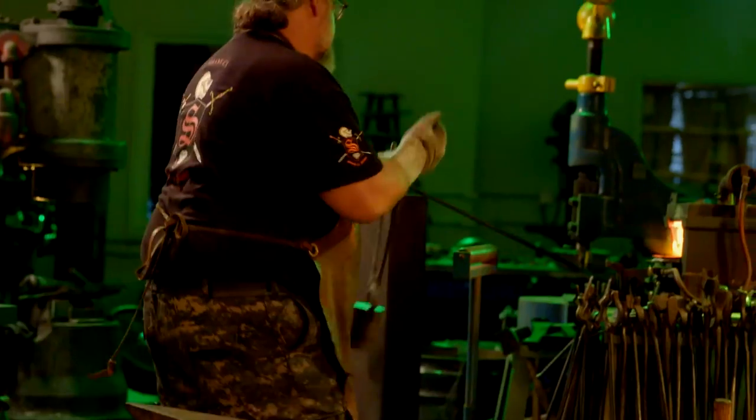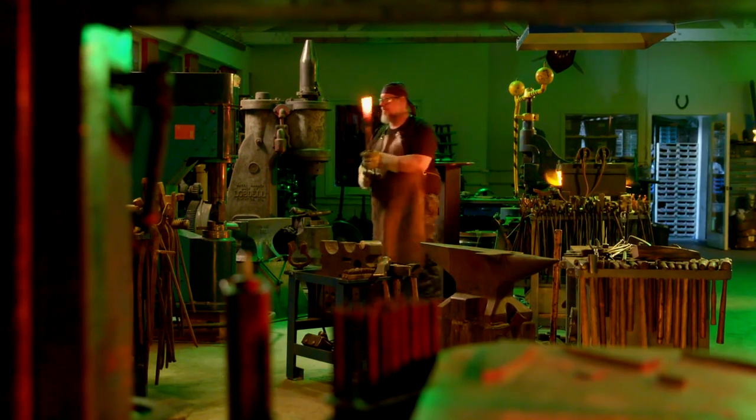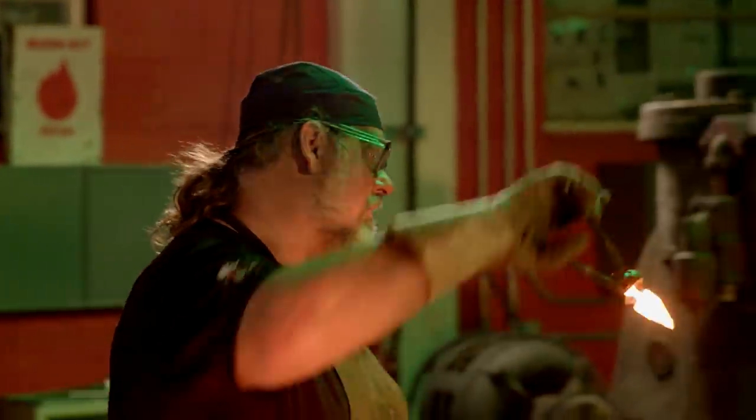To begin the construction of the pommel, I'm going to take a three-inch diameter round bar, put it into the forge, and bring it up to a temperature of about 1,600 to 1,800 degrees, and smash it until it looks like the pommel that I want. The pommel for Doomhammer has five steel spikes coming off it. I'm going to forge those out of an inch and a quarter chromoly 4130 steel — it is hardenable and extremely tough. We'll heat them up to the critical temperature, which is about 1,575 degrees, and quench them in oil to harden them. They'll actually be more effective for smashing and penetrating skulls and bones and, you know, whatever gets in the way.